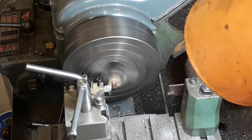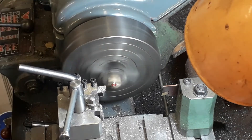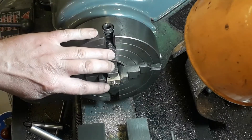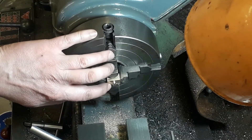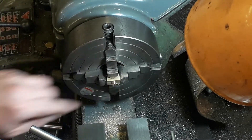This one goes down — I think it's seven-thirty-seconds in diameter on the outside — with a nice sort of radius that we're machining. This is also taking it down to size. From the front of the boss to the back needs half an inch. There it is with a nice little radius on the inside of it.